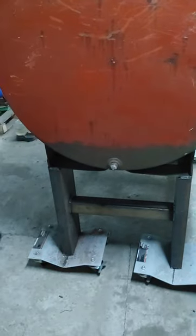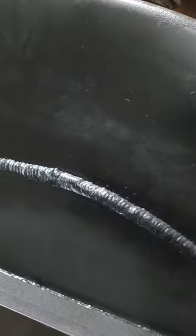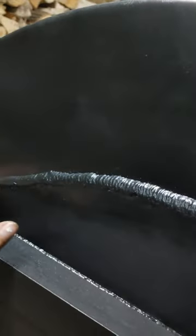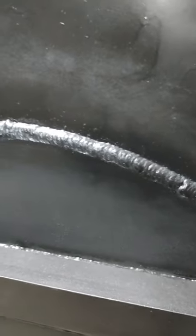From the fire. The tank wasn't rotted through but it does have heavy rust on the bottom, which made it kind of challenging to actually weld the propane tank into it. You can see I have a giant weave all the way around it. I set the welder really cold and just went through weaving — if I moved too slow it burned through, if I moved too fast it just built up, so I set it low and weaved it on there.